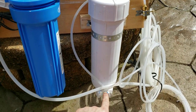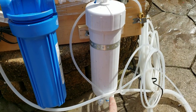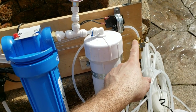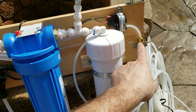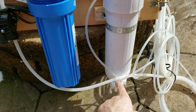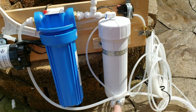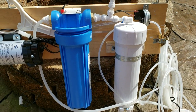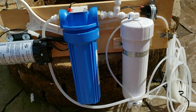When it goes through the RO, it's actually separating out pure water from concentrate — the sap that still has sugar in it. There's also a pressure switch to shut this off if it goes below or above pressure. The needle valve controls the pressure on the overall system, keeping it so you get about 50% concentrate and 50% water being rejected out of the RO. That rejected water is referred to commonly as permeate. This cuts down on your boiling time significantly and your fuel use by about 50% if you double the sugar content by cutting half the water out initially.